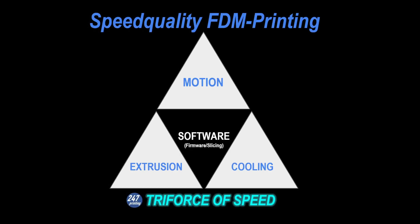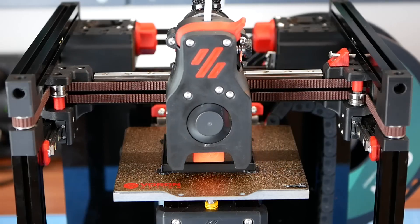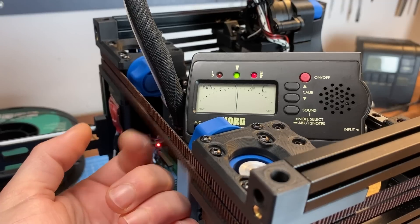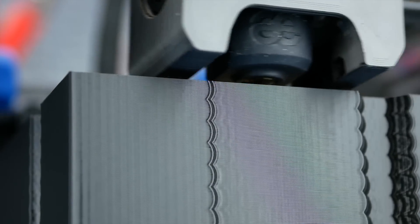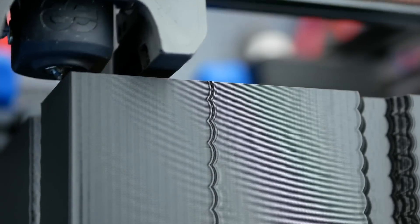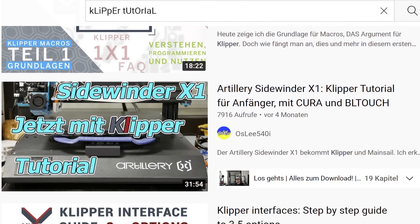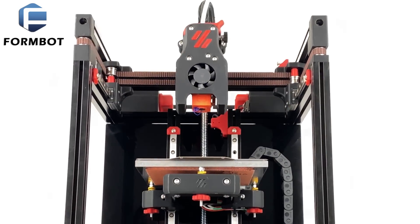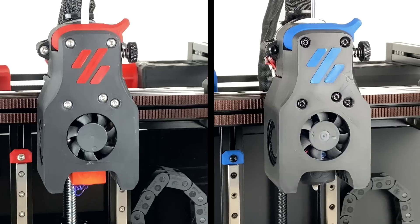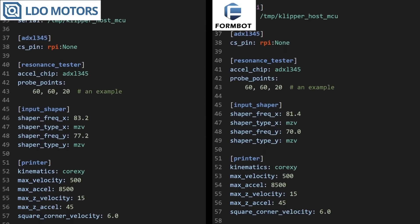Slicing and printing a fast-quality 3D Benchy will help to check out all of these factors. Both printers are calibrated and equally set up concerning E-steps, pressure advance, equal belt tension, and I did the resonance tuning. I also did test prints in order to define the highest possible acceleration with low or no ringing. There is not much difference concerning moved masses between both kits and the build quality is more or less equal, so there is hardly any variation concerning the firmware settings.